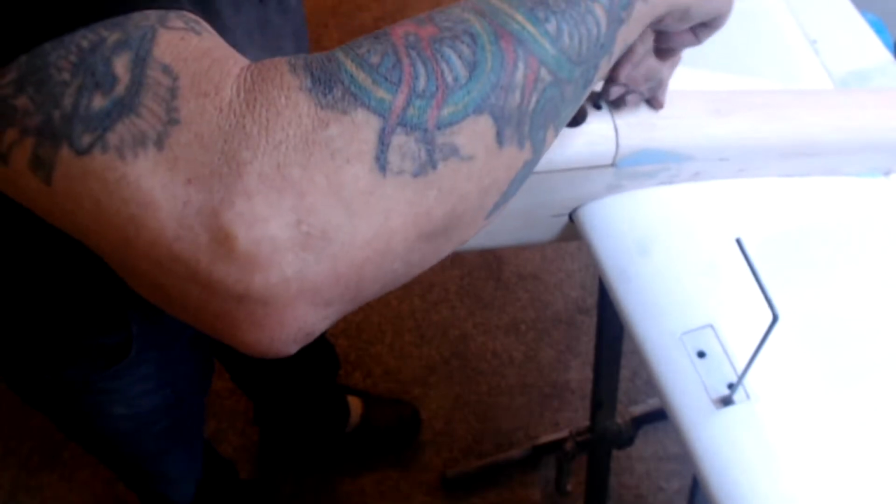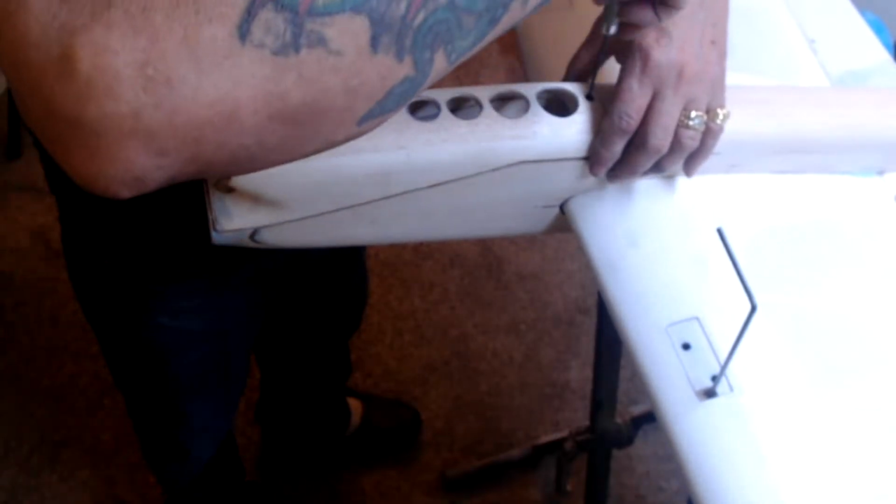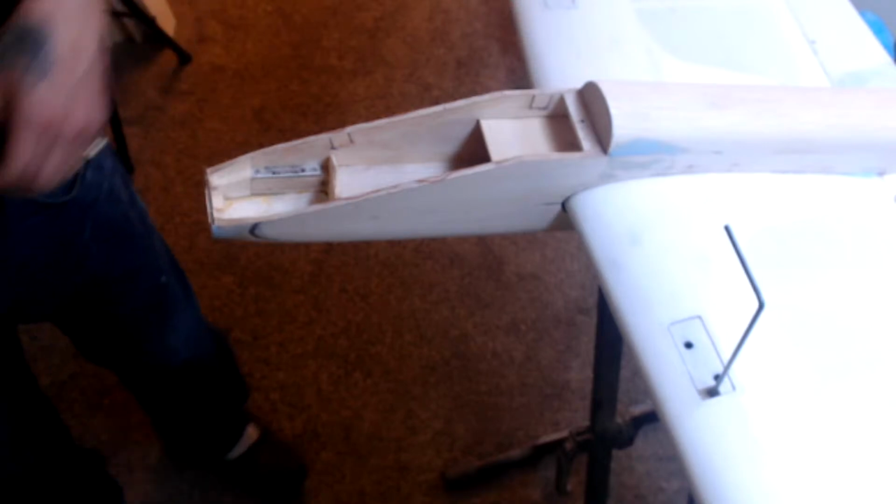What happens is, I'm going to get a longer screw in there so I make sure that it's started. What happens is they crack from the vibration, high frequency vibration. You'll notice right at the trailing edge of these airplanes, and use a 3/4. Right at the edge of the trailing edge on these airplanes, there's always a stress crack. Well, there's a way around that.